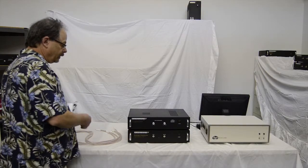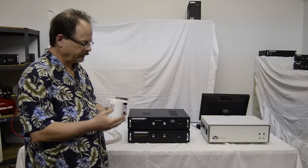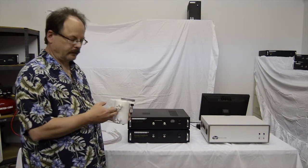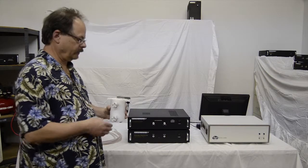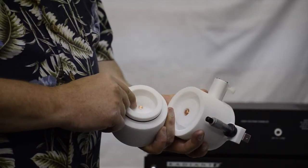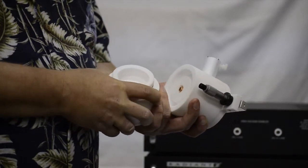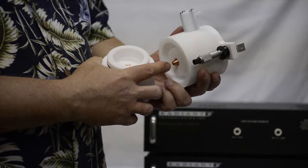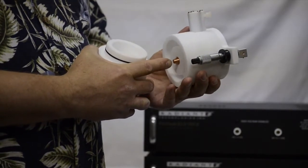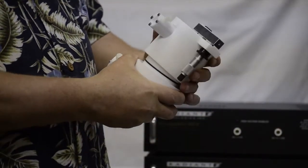I'm going to demonstrate using a high voltage test fixture manufactured by Radiant Technologies. This is a general-purpose high voltage test fixture that has an additional function allowing an MTI displacement meter probe to be engaged, so you can make piezo measurements using this HVDM. Opening the test fixture, there are two electrodes: the bottom electrode is fixed, and one electrode of the sample contacts it. The opposite electrode contacts a copper electrode that is free to move. As the fixture is closed, it accommodates variable sample thickness and detects motion for piezoelectric effects.